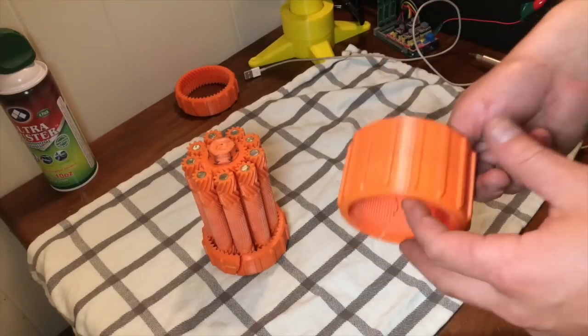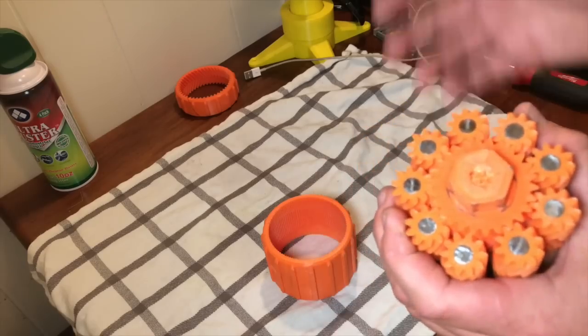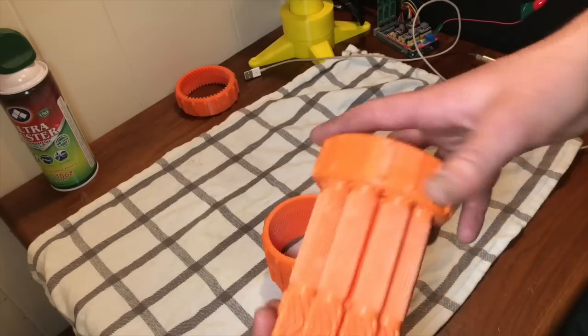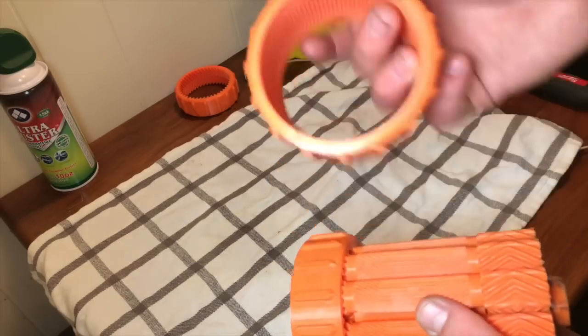So I've already shot this part like 3 times and frankly, I'm getting tired of it. So this is the gearbox from shooting today. The same one that I used for lifting the anvil. I haven't modified it. All I've done is take it apart. These gear teeth, these are the ones that I'm pretty sure were skipping on this ring gear. They weren't getting a grip on it.